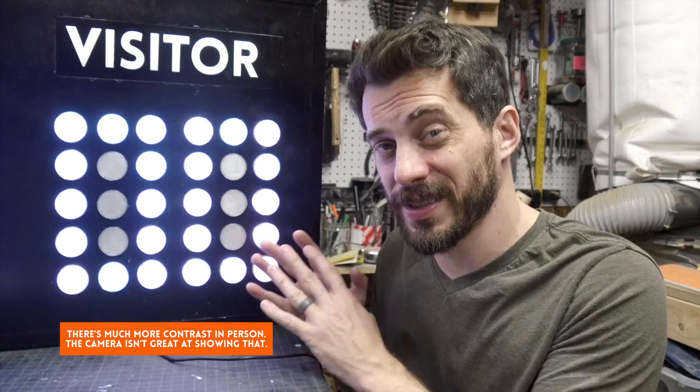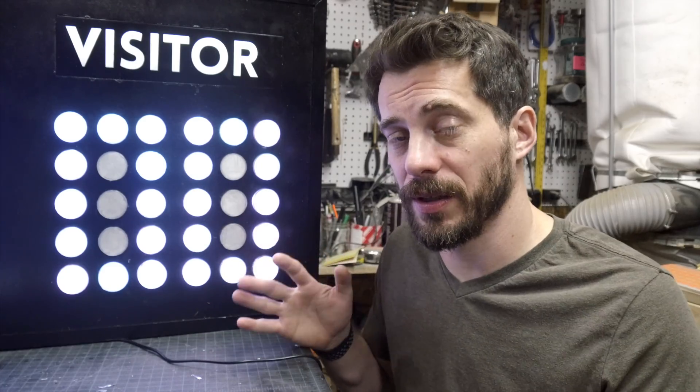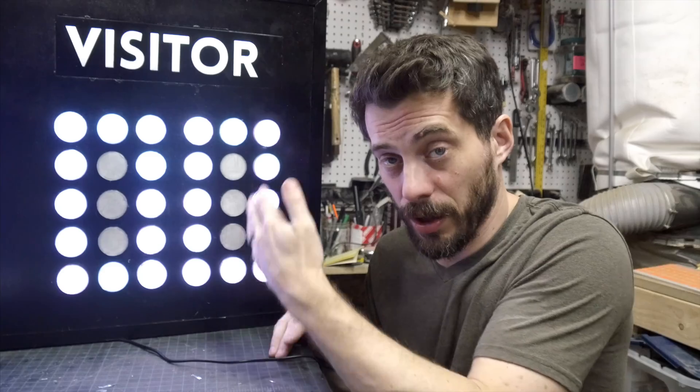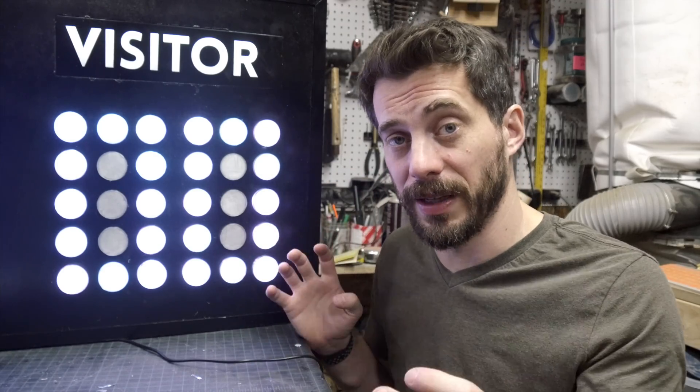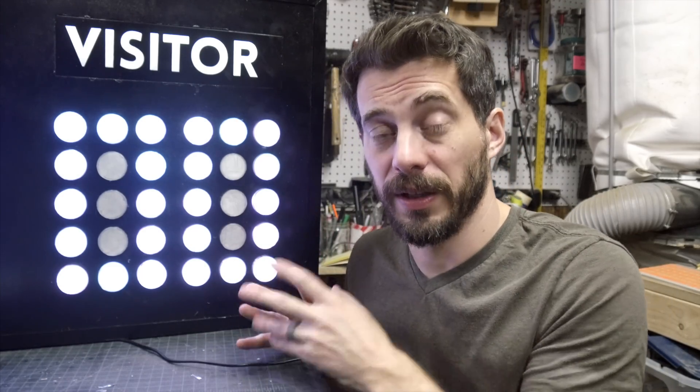Each one of these characters is made up of 15 LEDs — five rows of three. To make up each number zero through nine, I had to write down the state of all 15 LEDs for that number. So to display zero, I wrote a list that said on, on, on, on, off, on, etc. all the way down. When I want to display a zero, I pull up that list and turn each LED on or off based on the next value. The rest of the code is really just about turning LEDs on and off and connecting to the Bluetooth. All of the Bluetooth code is straight from the example code provided by Intel. It's very easy to change the color of the RGB LEDs or change the way things work. The link for that code will be in the description.